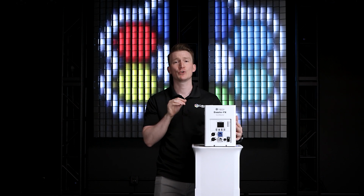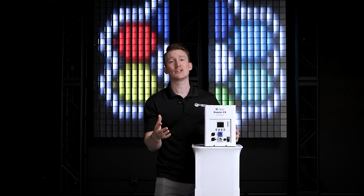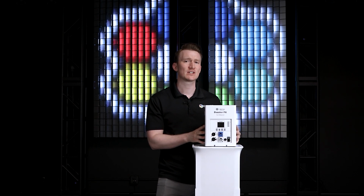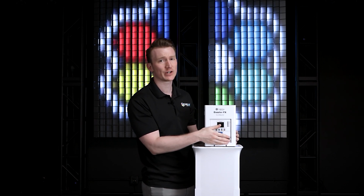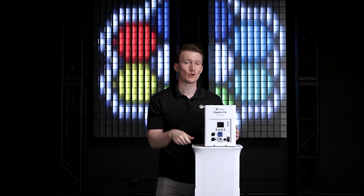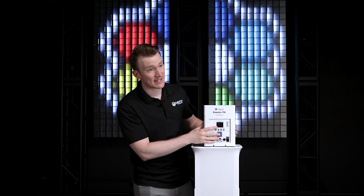I'm talking about when you go to set up for a wedding, you put them around your dance floor, you test them, but then the grand entrance or that first dance isn't gonna be for 2, 3, maybe even 4 more hours. There's no need for the unit to constantly be sitting there at a very high temperature. So you can either just turn it off here, or if you're running DMX, to turn off the heating element. Then when you're 15, 20 minutes out from the big show, turn it back on so it's heated up and ready to rock.